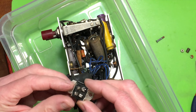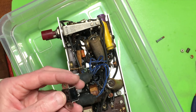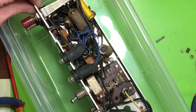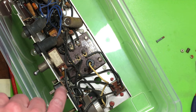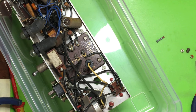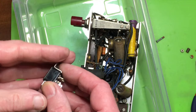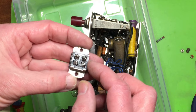That's the replacement socket. It's not quite the same as the originals. It's the same standard for the connector, but the original, if you can see there, is an older style that has a Paxolin base where the terminals come through it. Same with the little two-pin remote control on-off socket. These are the oldest style I could get, which look the same from the front, but they don't have the Paxolin.